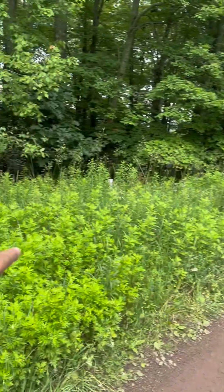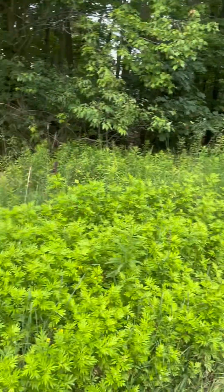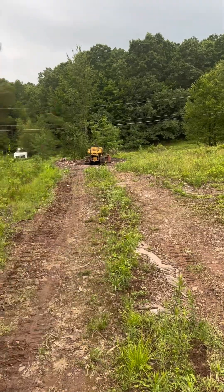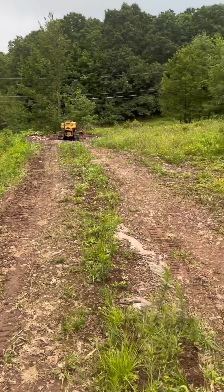I've got to run the sewer line down through here. That water spigot is not even turned on - the water is only turned on if we need it but it hasn't been used in about 20 years, because it's not deep enough to keep it from freezing. So I've got to fill this in, dig that up, and try to get it deeper. But basically this is a future driveway I'm working on.